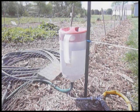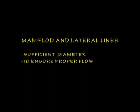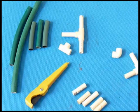If used in tandem with the water barrel, then the gravity pressure in the barrel is controlled by this canister. To ensure enough water flow in a very low-pressure system — less than 2.5 feet or 1 psi — the manifold and lateral lines must have large diameter. It is our experience that 5/8-inch garden hoses and 1/2-inch CPVC connectors such as tees and elbows work very well. Remember, this is for very low-pressure.